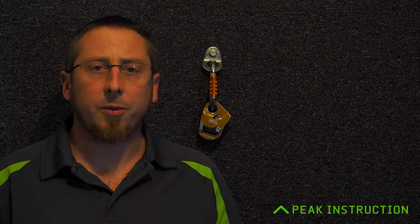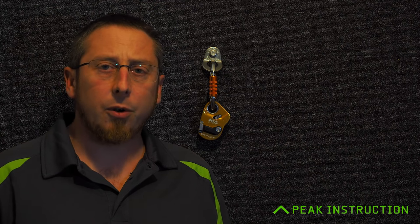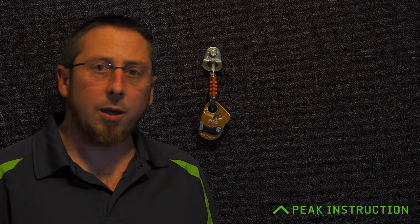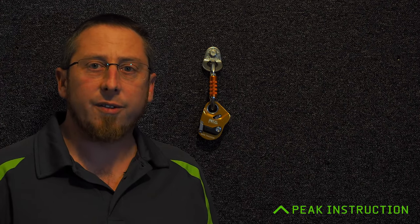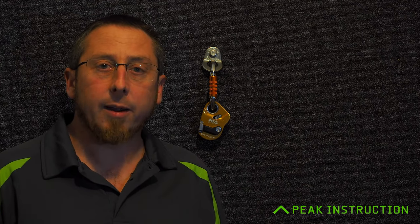The Mini Traction is particularly suited to underground vertical leading. In the hands of a skilled and trained operator, it can be loaded on and off the rope without disconnecting it from the anchor point, which makes it drop-proof. The cam can be locked open so you can convert your hoist back to a lower when required. It's a small, compact, relatively lightweight, highly efficient package — and at current prices, it's not going to completely break the bank.